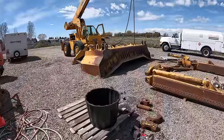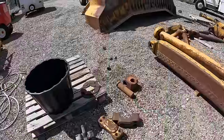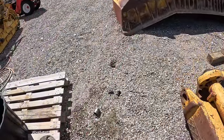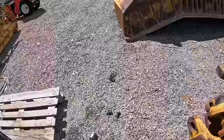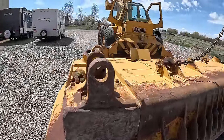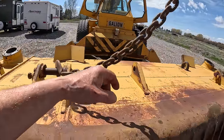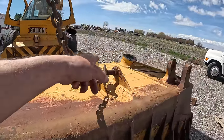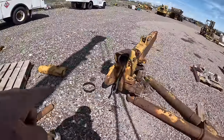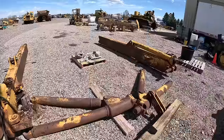So I got the dozer blade flipped and I used that thing to get those two three-quarter bolts out, but it wouldn't do it until I heated them up cherry red and let them cool down. So I got to get these holes bored, and that one, and this one, and probably these down here. So anyway,